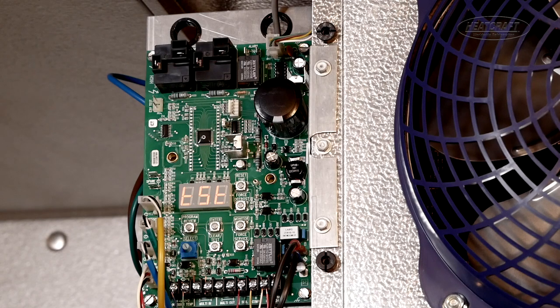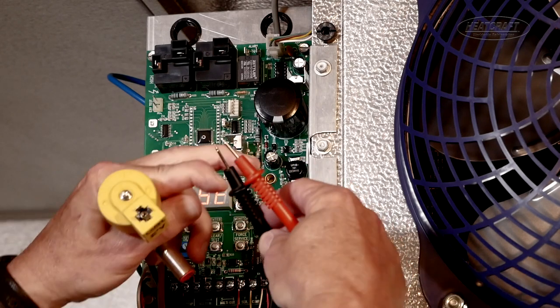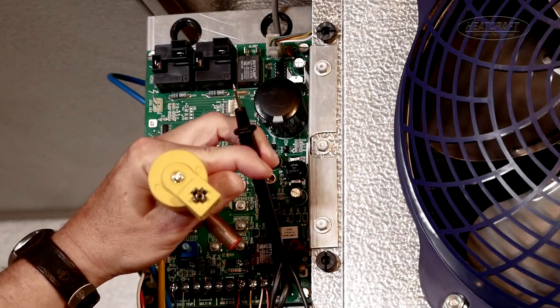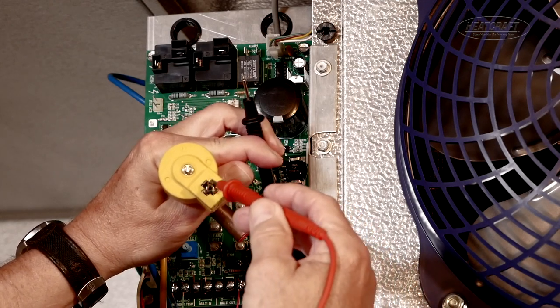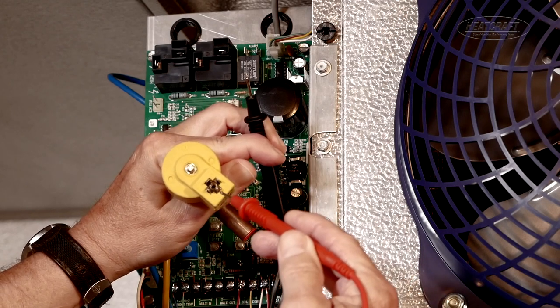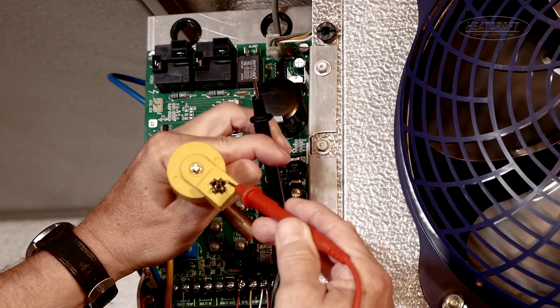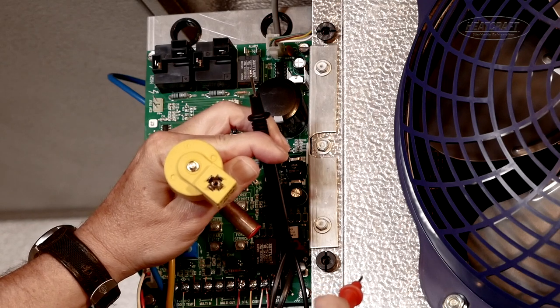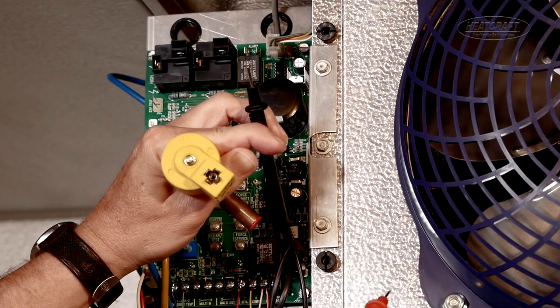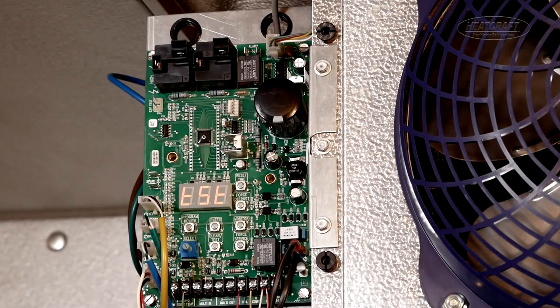It's a very good possibility that your valve powerhead is the culprit and not the valve body itself, so we don't want to unbraze if we don't have to. You can go to your manual and it will show this in better detail. You have terminal A and B — the ohms between those two should be 150 ohms. You also have C and D — the ohms between those two should also be 150 ohms, plus or minus 10%. If you are getting that proper ohm reading, then it's just your powerhead that's the culprit. When you receive your new valve, all you have to do is replace the powerhead. But if they do not show proper ohms, you will have to put in a new valve and unbraze the old.